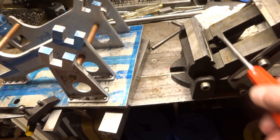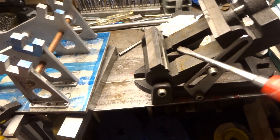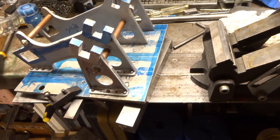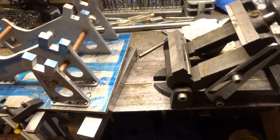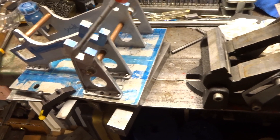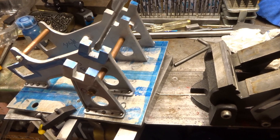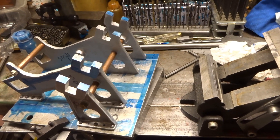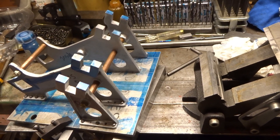What I intend to do - I don't know if it will work - is to fix this into my angled vice at the relevant angle such that these bearing seats become vertical, and then attach the whole lot onto my milling machine, which has enough travel so that I can hopefully run a cutter right across from side to side. Will it work? I've got absolutely no idea.